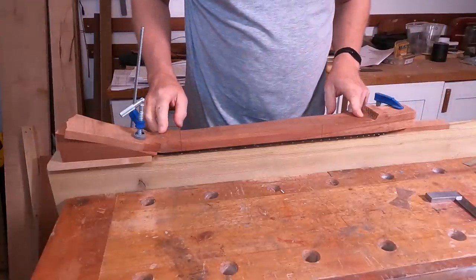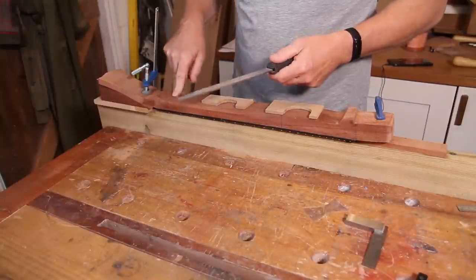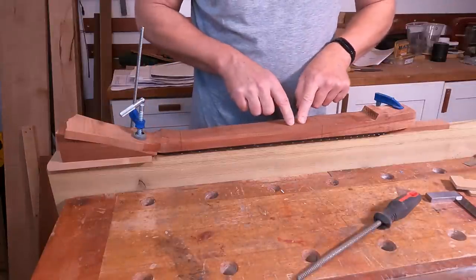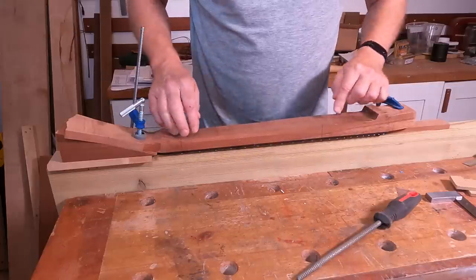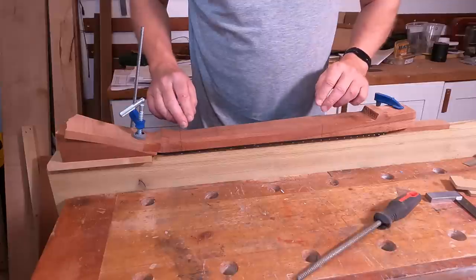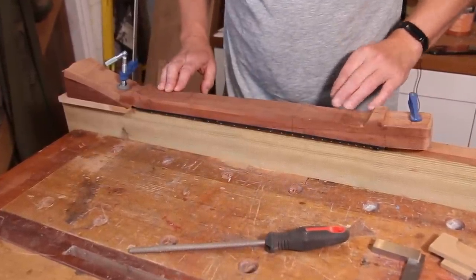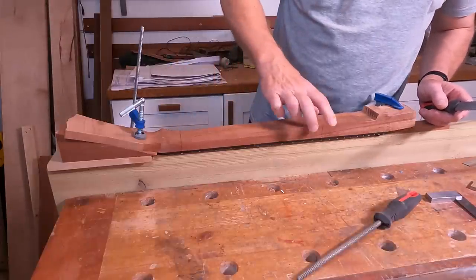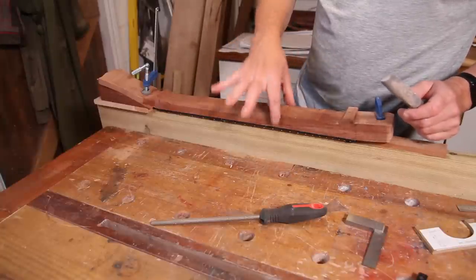I'll get this set up in my highly technical neck holding jig. If any of you haven't seen this operation before, it's quite straightforward - we'll take the templates for the first and twelfth fret, we will rough those positions in with a couple of rasps just to get us somewhere near, and then once we've done that we can start to divide what's left up on the center section of this neck into quarters, cut those away into facets, and then we'll just repeat that until eventually we get it all to a uniform nice radius. It's worth bearing in mind that this neck blank is still a little bit thick - probably about two and a half to three mil thicker than we need to be along most of its length.